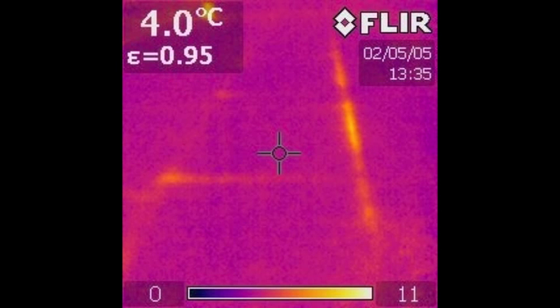Here we have a photo of a traveling roof leak. In the upper part of the photo we have where the roof leak is actually coming in, but you can see the water traveling across the insulation — it actually goes diagonally across the insulation and then back down again. So you can have water zigzagging across the roof and leaking in a different area, but where the actual hole is and where it's coming in is a different area than where it's coming in on the inside. With infrared at night we can see traveling water, which helps a lot with repairing the roof — we can repair the actual location where it's coming in even though it's traveling.